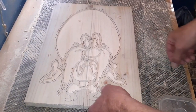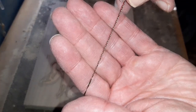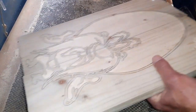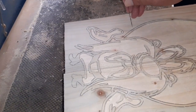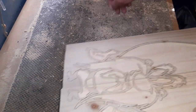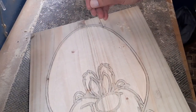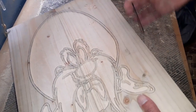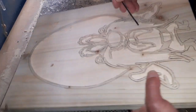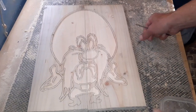It's a personal choice. For me personally, I like to use spiral blades. Now the teeth are spiraled the full length, and they will cut in any direction. So we can basically start there and then just feed the wood gently across like that and all the way. Whereas with your normal pinned and pinless blades, you would have to start here, let's say, and you would feed that and then turn your wood to feed it into there, and a nice turn again to feed that way, and then turn again and turn. Just too much for me, so I'll just stick with spiral blades.